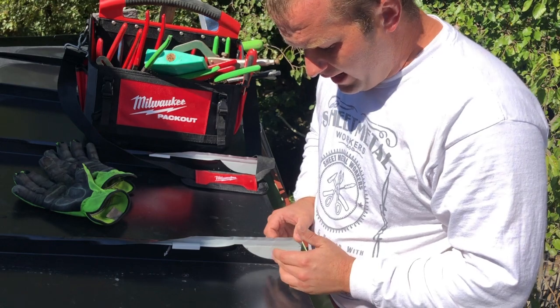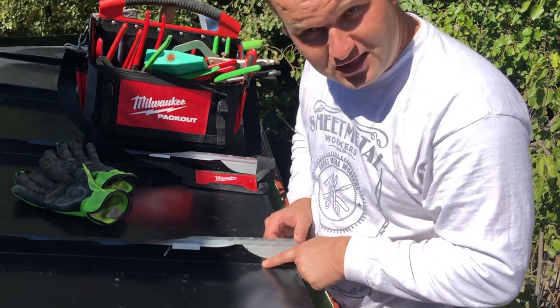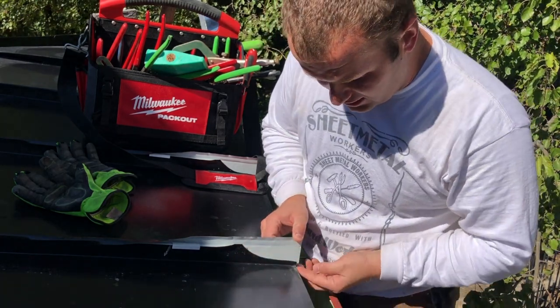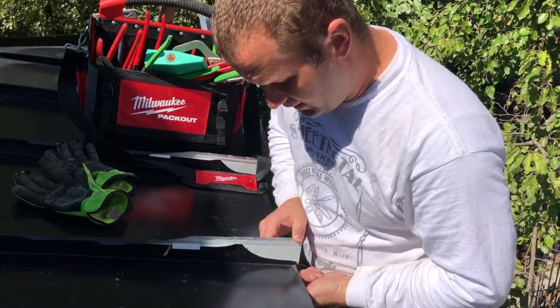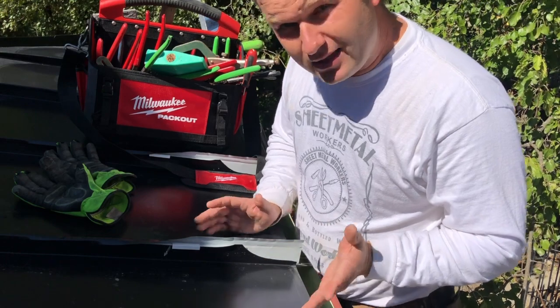And what happens is, as water comes down the roof, you've got surface tension, you've got some traction here, but that water is gonna actually catch the edge of your panel and then slowly start to creep back uphill. And it'll get right in between the seams here, okay? It doesn't seem like that would be the case.